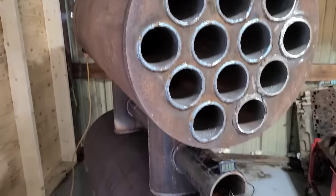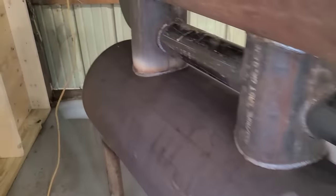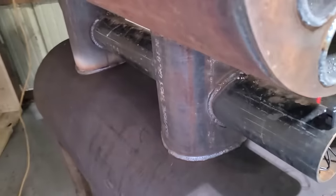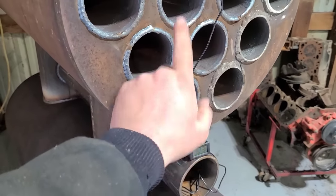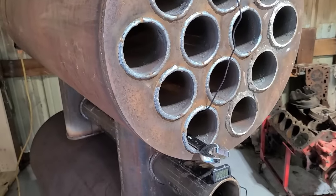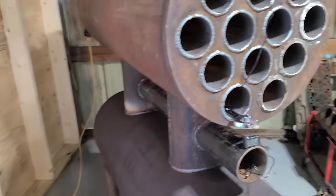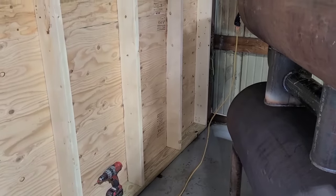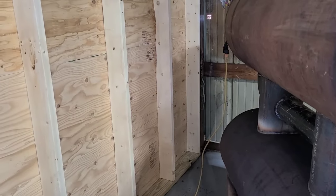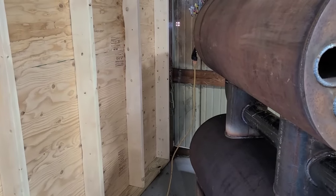Other than that, it seems to be doing pretty well. I'm surprised we're getting the high temps out of here that we are, but that was the theory behind putting this right in here — to capture all that heat and get rid of it right away. I moved that probe down here. The wrench is just to hold the probe so I can slide it back farther. About 30 degrees warmer in the air down there — 130 degrees, I can live with that. I think one of the next bigger projects is going to be insulating and putting something on these walls. I don't need that heat drying out that wood and warping it, or worse yet, causing a fire. If I put some tin or a shield on there, we should be plenty fine.